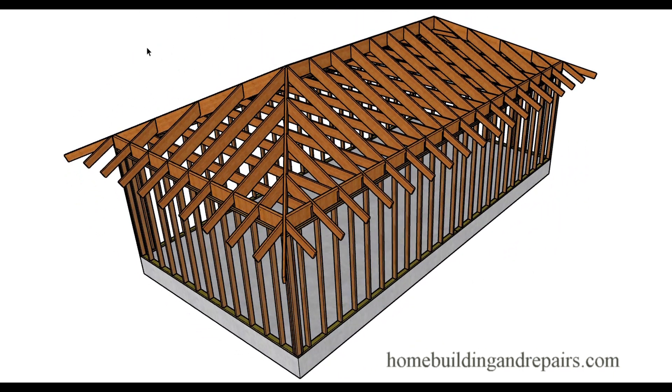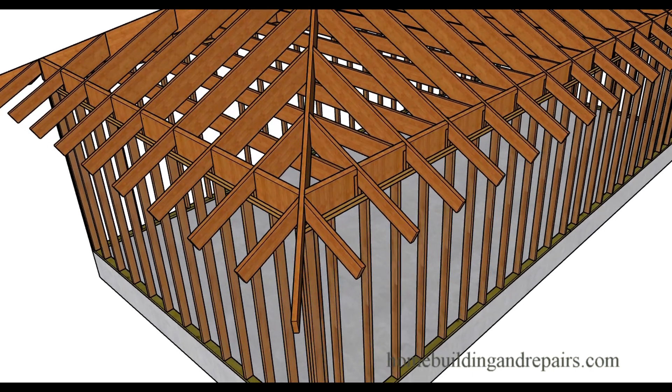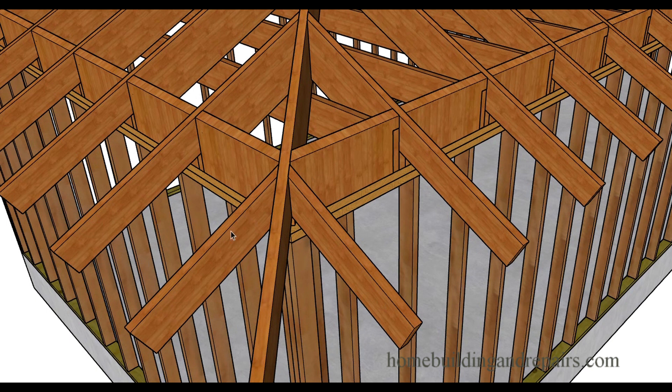These are jack rafters or fill rafters. Let's zoom into the bottom here. A couple of rafters at the bottom — we used to call these flyers or fill rafters. A flyer was something that was just kind of hanging there; the fascia board would help to support it. We have shaped blocks — these blocks are cut at an angle at the same pitch. To scale, this is a 6 and 12 pitch, which is something like 24 to 25 degrees, and you would cut the blocks at that angle to match the pitch of the hip.